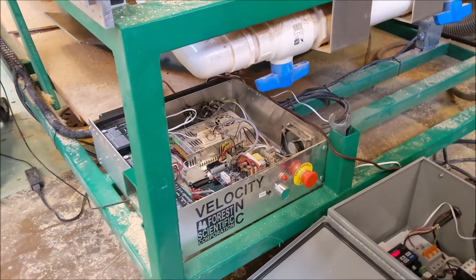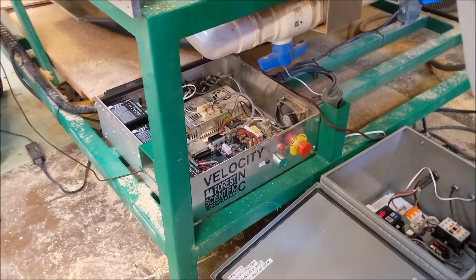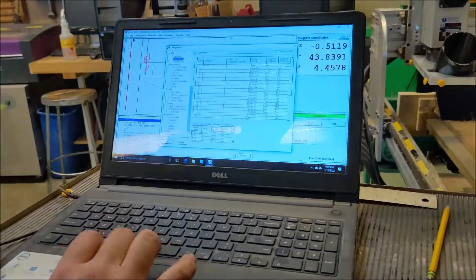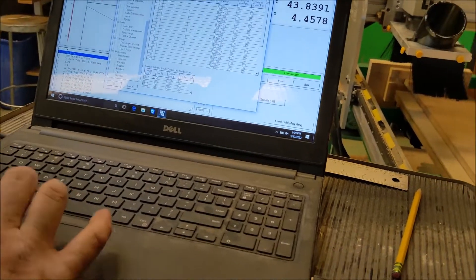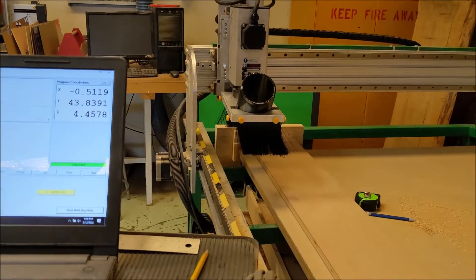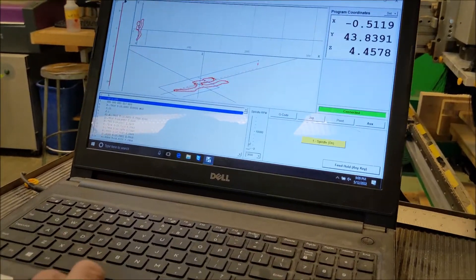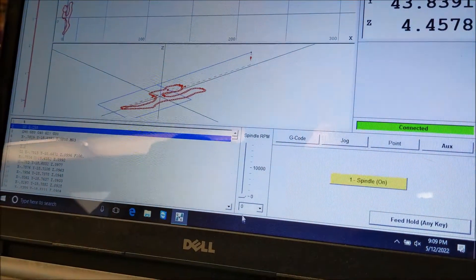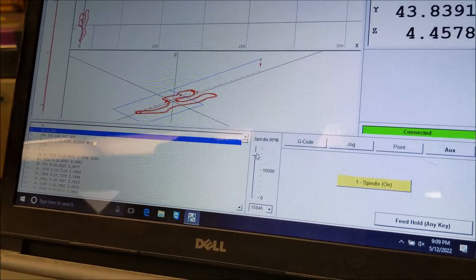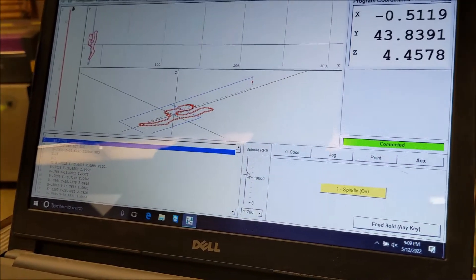So now this will be the first try of this, and I'm sure it's going to be right. I'll come in here, get out of my output screen, and on — and there we go. We have our spindle speed right here. That would also be controlled by an S-code: M3 turns the spindle on, S18000 would be 18,000 RPMs, S10000 would be 10,000 RPMs.